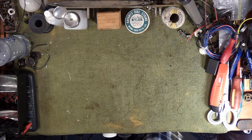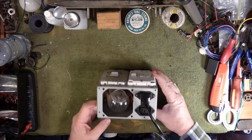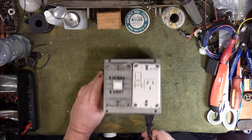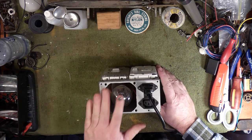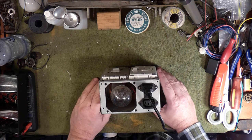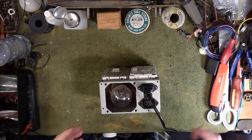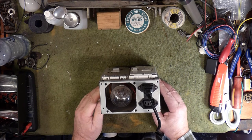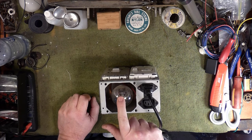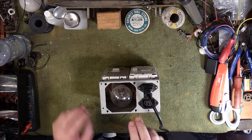If you've seen any of my videos you've probably seen this little beastie, which is my dim bulb tester. It generally carries a 60 or 75 watt bulb — it's running a 75 watt bulb at the moment. All it is is allowing the mains coming into the radio to pass through this bulb. At maximum brightness this bulb will allow 75 watts to flow. It puts a cap on current, so when you run a faulty radio through this, the radio ends up acting like a short circuit. All the current flows through the bulb, and you end up lighting it up brightly. If you see that, you know there's a problem — you shut it off. In the meantime, because this was in circuit using all the voltage, the radio is somewhat protected.